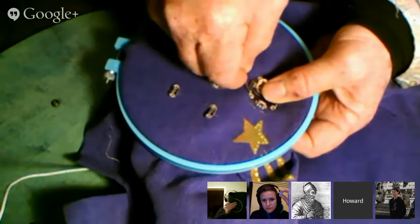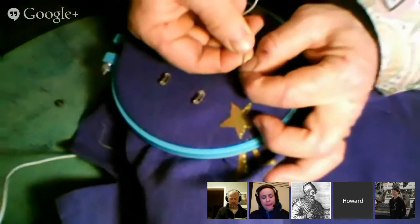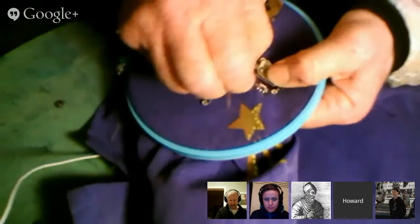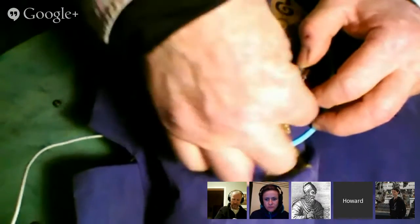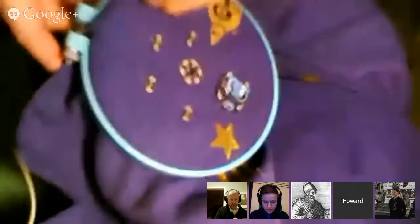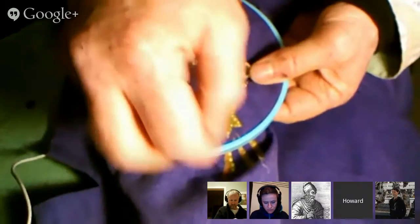The answer is that that's a risky thing to say, but yes, lithium batteries are naturally current limiting. The reason that you put resistors in circuits with LEDs is to basically slow down the current flow, because LEDs will burn up if too much current flows through them. Usually in an ideal situation, a certain voltage going to a certain resistance will deliver a certain current, and your AA battery will behave in that way. Lithium batteries, because of their chemistry, are current limited. So at some point, no matter what nominal voltage they have, they just won't pump out any more electrons.